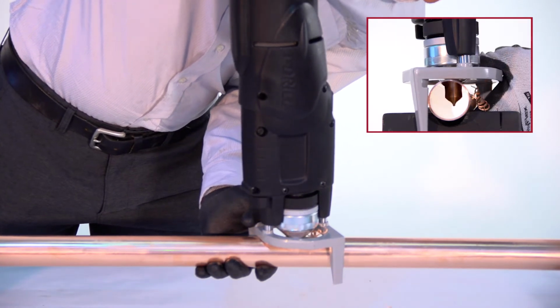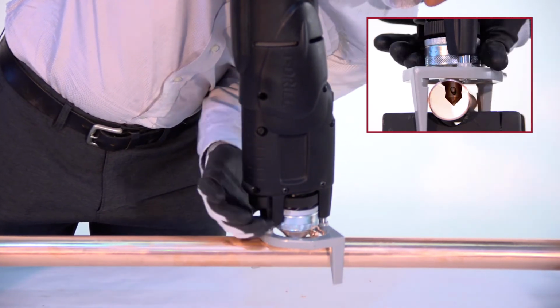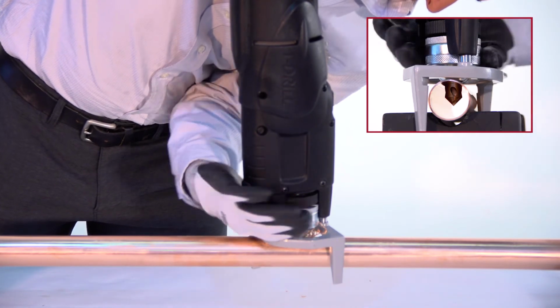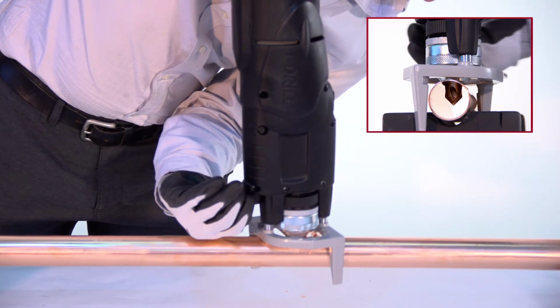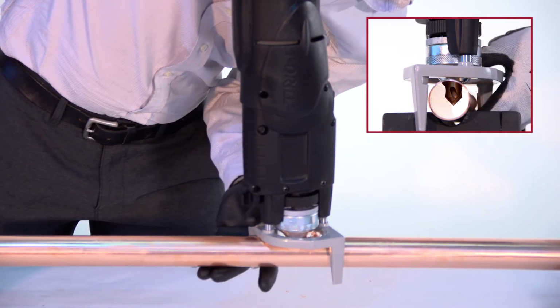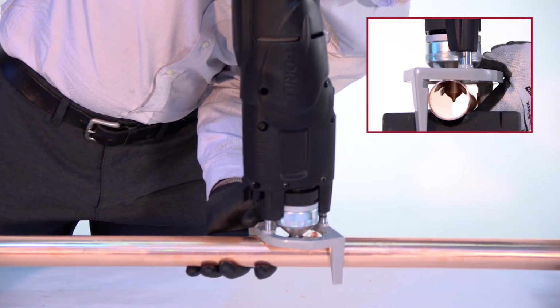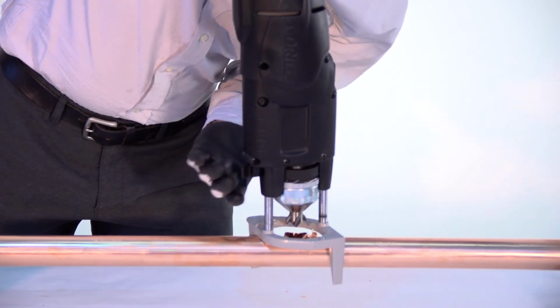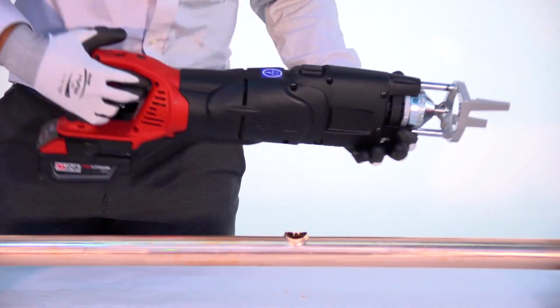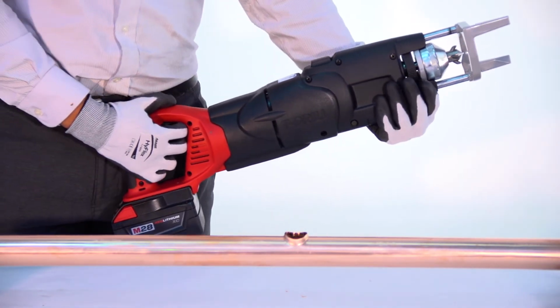After the drill stops, pull back on the T-drill head and turn it counterclockwise. This extends the forming pins. You will hear an audible click when the forming pins are fully extended. For some large size outlets, the instruction chart will tell you to use a slow speed. Engage the feed mechanism. The power legs will push away from the tube as the outlet is automatically formed.